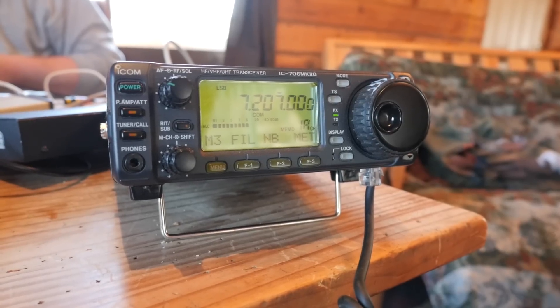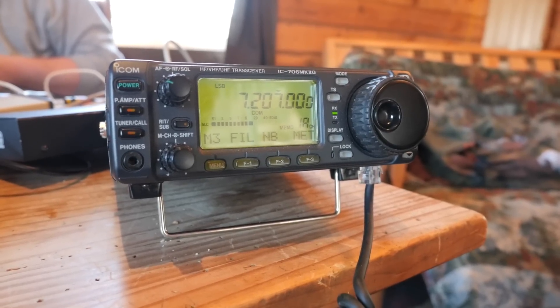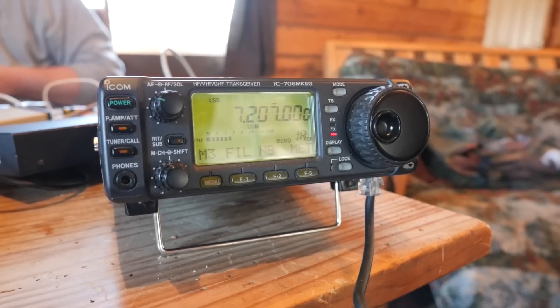Let's talk about this in a little more practical terms. Most HF transceivers have their S-meters calibrated in 6 dB steps, meaning a step from S8 to S9 signifies a 4-times power difference. So switching between RG-8X and a low-loss cable will barely cause that meter to wiggle, and it certainly won't affect the readability of your signal. Low-loss cables like LMR400 can be about 4 times the cost of RG-8X, so the extra investment in cable isn't worth it for the marginal gains you'll receive on the HF bands.